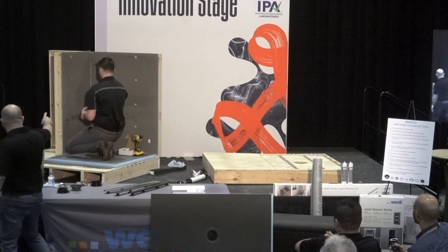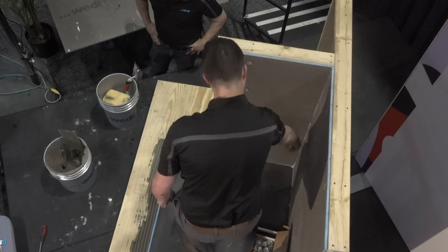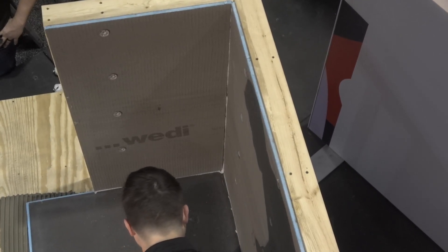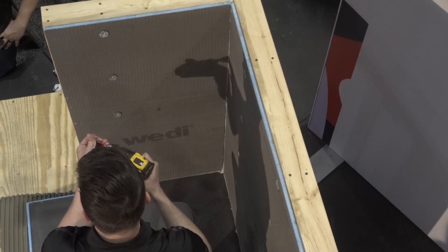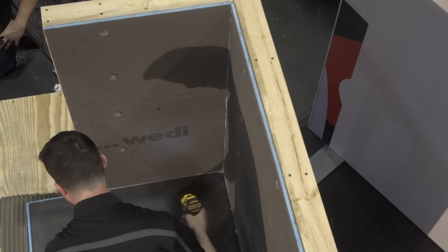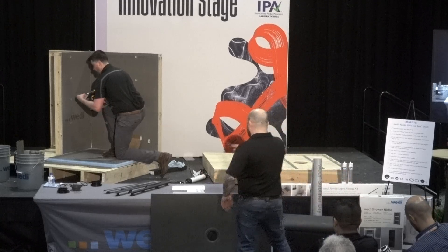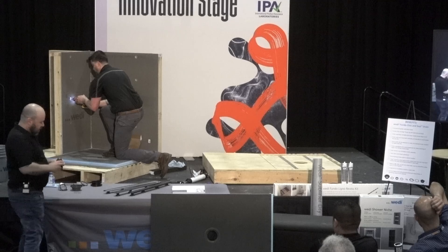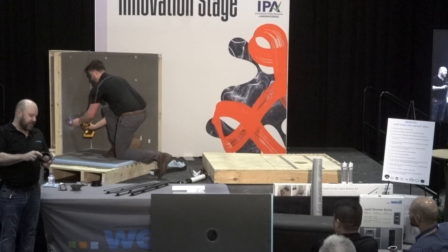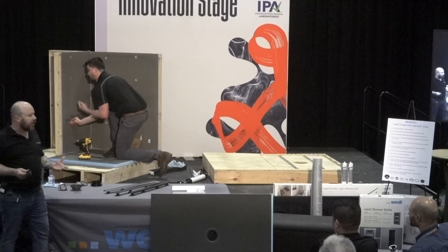On this second panel Greg has installed, the only difference besides the half-inch bead of sealant in the channel is that he also put a half-inch bead vertically to connect to the first panel. Wedi will never touch Wedi without sealant in between — whether it's a curb, extension panel, building panel, or shower base, there's always sealant between the Wedi parts and pieces. Back to the click and seal: once the drain is assembled later in the process, we have an extension kit for the drain cover — easy to screw up and down for height adjustment, and we also have lateral movement for the perfect grout joint.